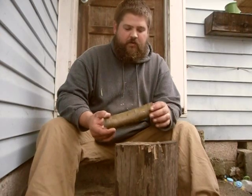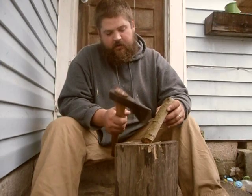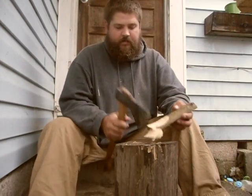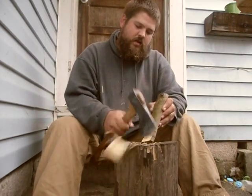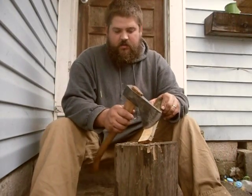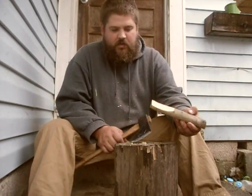I'm thinking about using this as my bowl, even though it won't stay in there for the most part, because when I cut my bowls I cut in from the outside of the bark. I'll start back about a third - if you cut this into thirds, I'll start about a third back on an eating spoon on the length, and I'll cut in. Then I'll let my axe turn out, like that. Because of the way I've got my axe ground, it kind of works like a little scoop. I've got it ground back towards the toe and back towards the heel of the blade, and it's got a real good convex grind, so it just kind of scoops an edge. This has got like a dip in it where it's scooped out. That's all I do for right now for my bowl - just like that.